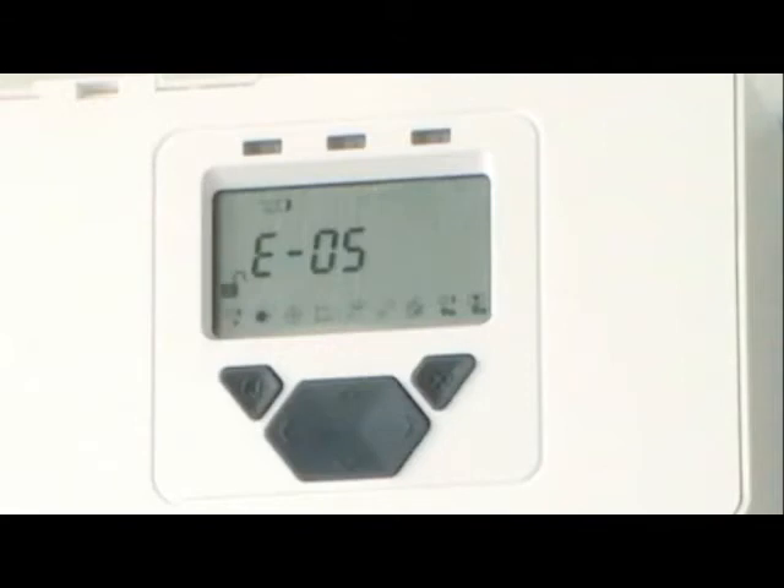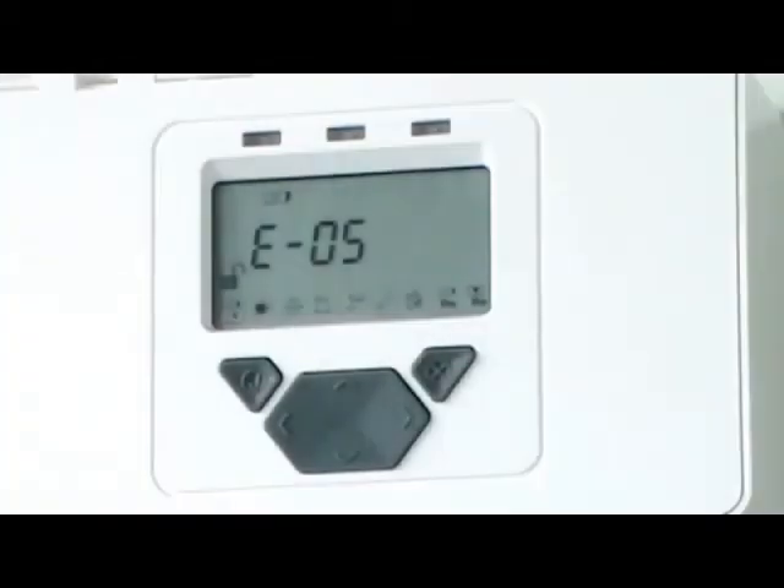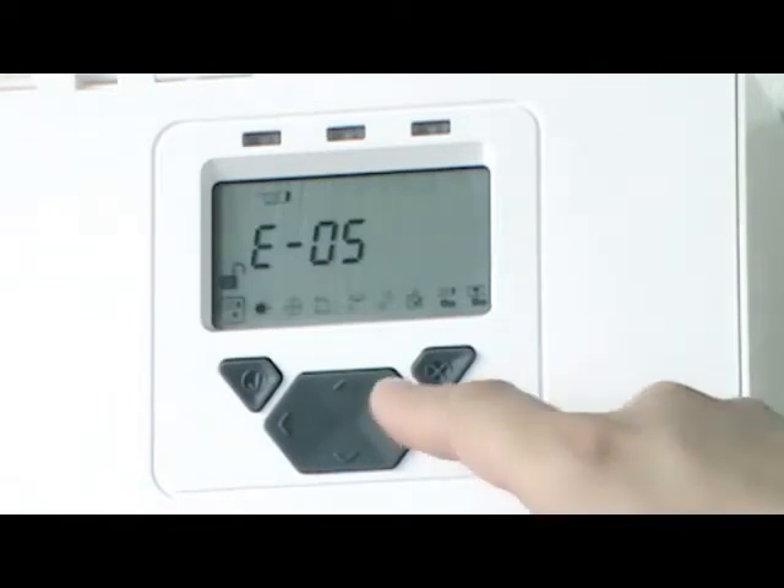The following stages are carried out for each receiver and transmitter pair in turn. You can select between receivers by toggling the up and down keys whilst in the Engineering menu. We will first align receiver 1. Notice how the receiver icon identifies which receiver is selected. The first stage of alignment is to align the receiver onto the transmitter using the integrated laser in the receiver. To activate the laser, select the second icon.